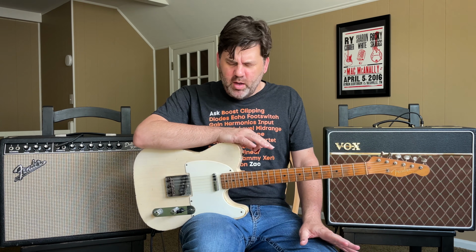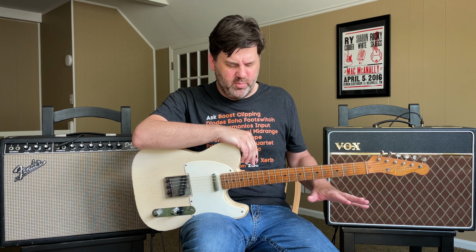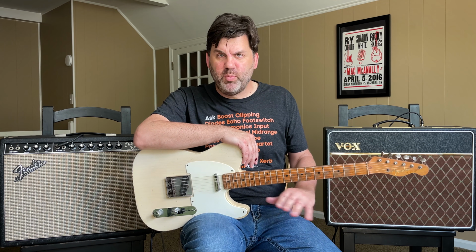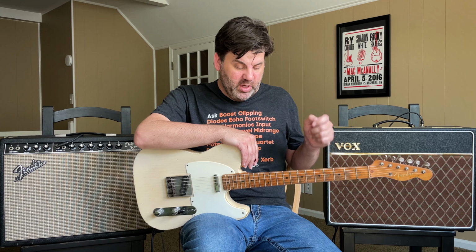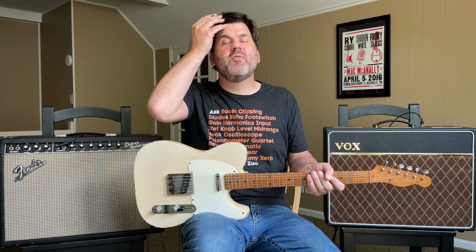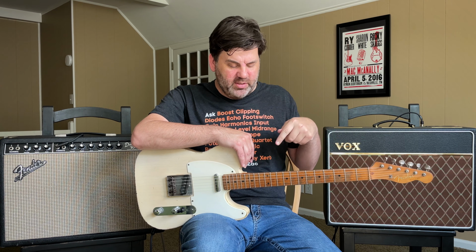So, one other thing, as far as the signal chain, to make things as even as possible, here, I'll just tell you what I'm using. I'm using an AB box, just like a Morley type passive AB box. Then because of ground loop issues, I have an old Axis Electronics buffer box that has an isolation transformer, and that's to prevent a whole lot of crazy noise. Also, that allows me to keep the amps in phase when at the end I play through both of them at the same time. So that's the signal.